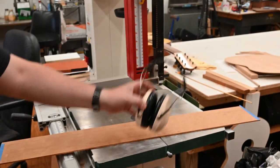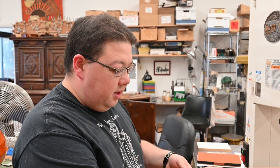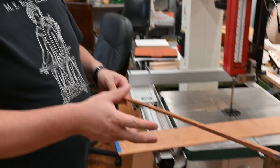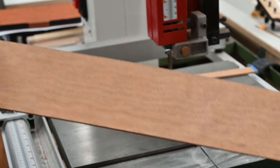Now we're at the bandsaw. I'm going to cut this out. I've got a 3/8 inch blade over here and my ear protection is down here. I'm going to fire up the dust collector because dust is the enemy of lungs, and we'll get this cut — it takes just a moment. So, that's cut. I like to save these offcuts — you can use them for rings, a rosette, or other design features if you want a mahogany or rosewood element, depending on what material you're using. I always save these; I've got mountains of this stuff. But you never know when you need a material like this. As you can see, I left just a kiss of a line. Again, it's not hypercritical. The important thing is that you get the general shape on here because we're going to be sanding and planing all of this at a later point. So let's get this bent.